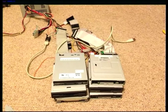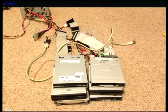So these are floppy drives here, and what this is here, this is an Arduino Leo stick. So I received this in my conference swag bag at Ballarat. It sat unused for a year or two, but I finally put it to some good use. So each floppy drive occupies two pins on the Arduino. One is for the step, one is for the direction.